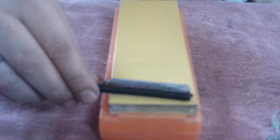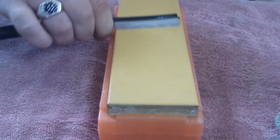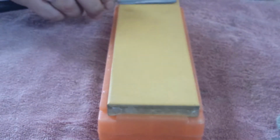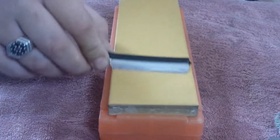Alright, some cleanup strokes. And I can tell by how the blade's feeling that the bevel is most likely set uniformly. Let's not forget too that the other thing I'm trying to do here is hone out that bit of a frown that came from the factory. This is a Thiers Issard blade, so the metal's really hard. Like the C135 carbon steel, it's a bear to hone.